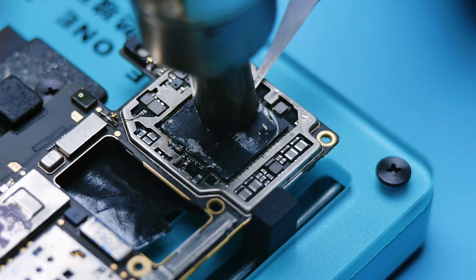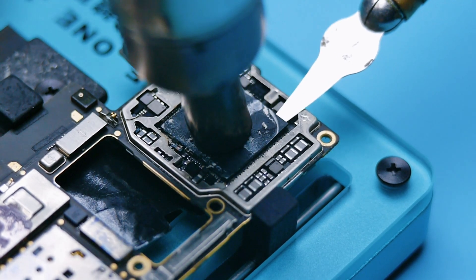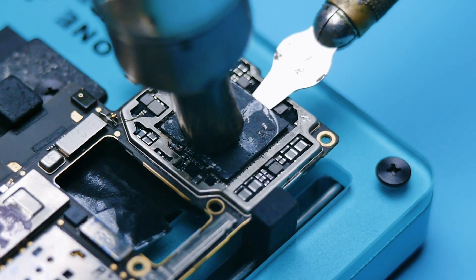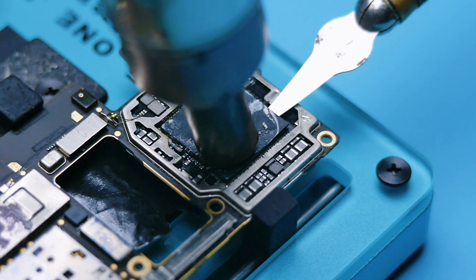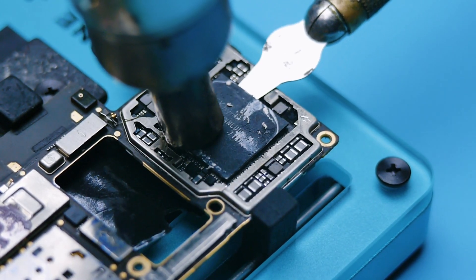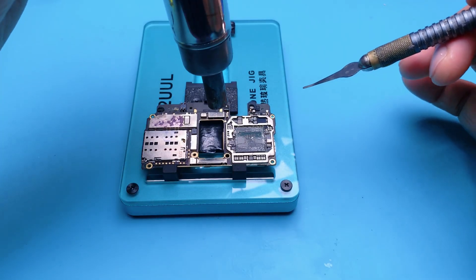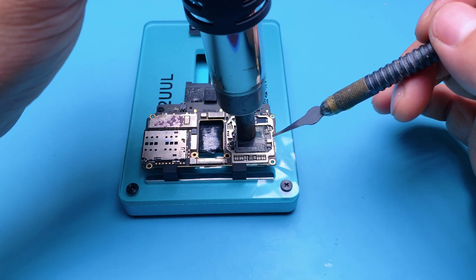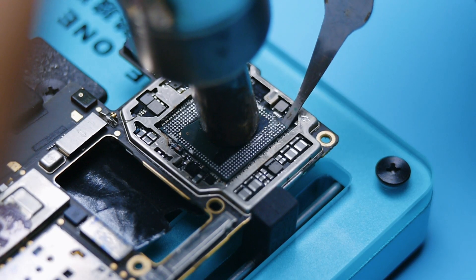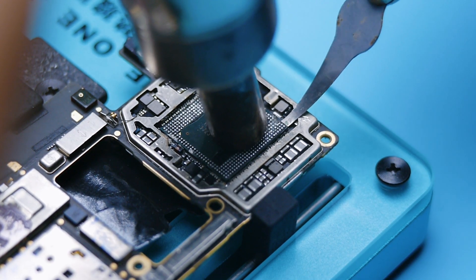Keep the hot air nozzle moving with the blade. Move slowly around the edges. Once the top cap is off, move on to the CPU die. Find a larger gap on the right side — this makes it safer and avoids hitting nearby components. Move the blade and hot air together and gently work around the chip until it's free.